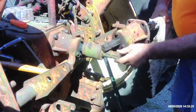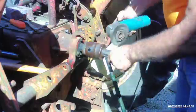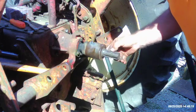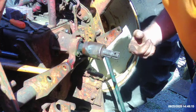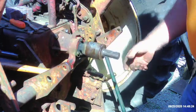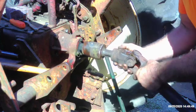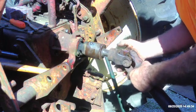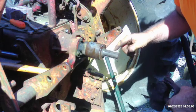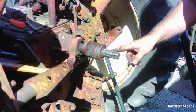Compare that to these guys right here — big difference. There's just a little wear on this ORC, so I'm going to see how that works with my power takeoff shafts. If it makes it a little bit too tough to slide on and off, I'll go ahead and pop it off and take a look at what the original spline underneath looks like. It goes on and off okay — pin lines up, put a five-sixteenths through there, and we'll be good to go. There's a little bit of slip in there, but I'm going to run this for a while. For the limited use this will see, I think it'll be just fine.